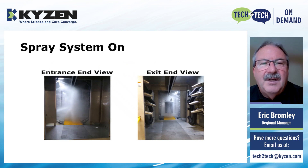Same picture, this time with the sprayers on. On the entrance end, you can see there's a small dead space at the entrance — that's to keep the moisture and spray inside the machine, so none of it comes out either end and gets on the floor or fouls any other operations. On the exit end, you can see the transformer exiting the rinse section and about to enter the dryer. Those elongated stainless tubes direct the air to specific parts of the transformer to blow dry and make sure there's no moisture for the paint operation.